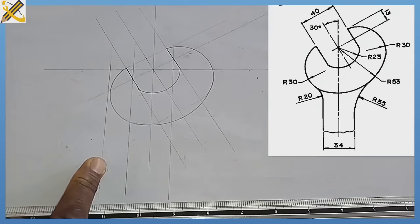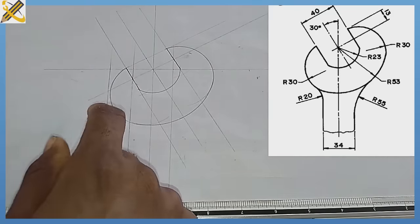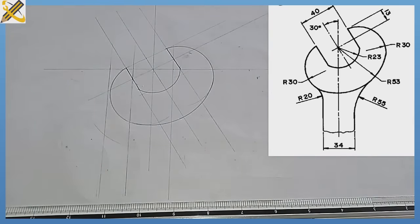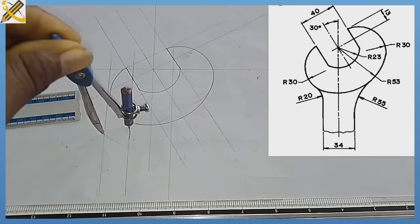From here to here is 20. The arc joining this area down to this area is an external arc, and we are going to apply the principle of addition — arc on a straight line. The radius of the arc of the 20 line is radius 30, so 30 plus 20 equals 50. From the midpoint of the arc of radius 30, with a measurement of 50 on your compass, strike an arc touching this line of distance 20. That gives the point of intersection. Then with radius 20, draw the intersecting arc to settle that area.